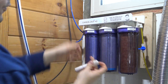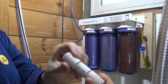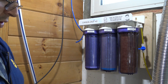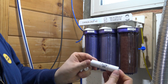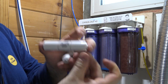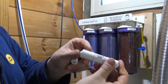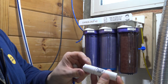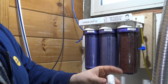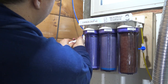What I'm going to do is remove this flow restrictor. This one was set for 40 gallons per day — I'll keep that because it's a perfectly good piece of equipment and we'll probably use it again. I'm going to replace it with this one here, which looks almost identical but has a different flow rating. This one is 80 gallons per day, and I picked it up at Gemco, but you can get it at basically any supplier that sells units like this. Note there's a direction of flow marked on it, so we want to make sure the flow is going in the correct direction — very important. It only goes on one way.